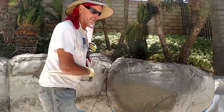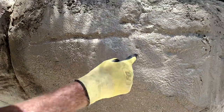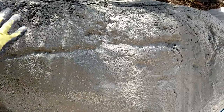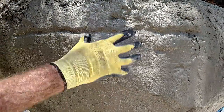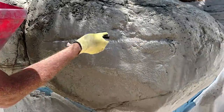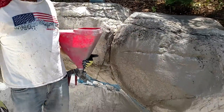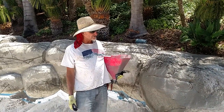The material blown on fills in all the little cracks and creates more uniformity. It already has kind of a rocky texture to it. Once this goes off a little bit, we're going to trowel in some cracks and finish it up. That's kind of how it works — you blow the stuff on, then trowel in your scratches and your texture, and it starts looking like a rock.